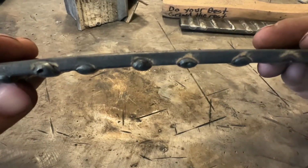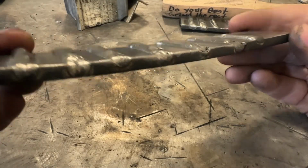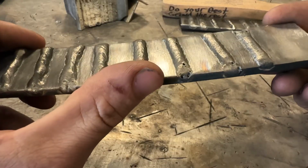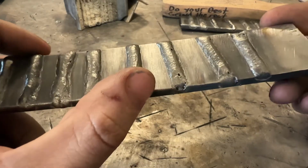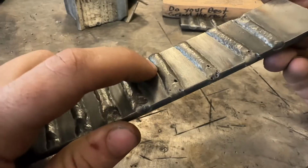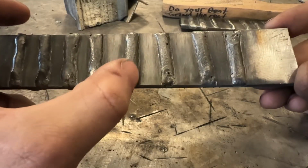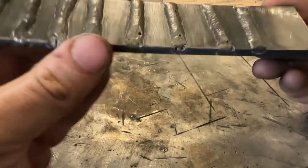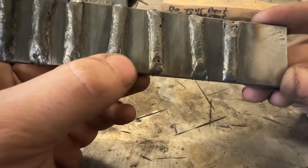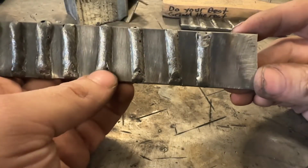Again, don't place too much weight on any kind of porosity. Based on what I see, again, if you eliminate the porosity, the actual weld, I would say, has more consistency than this guy. If the whole weld looked like this, where my thumb's covering the screw up, I would say very acceptable. Toes are not cold, it's wetted out very good, it has a good profile. So this is looking pretty good. Controlling the stop a little bit better would have solved that porosity issue. You can see the amount of underfill, like you cut out too fast, guess what? If you look there, there's very little weld metal. So that's just simply working on stops.